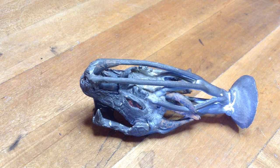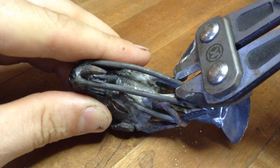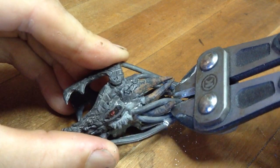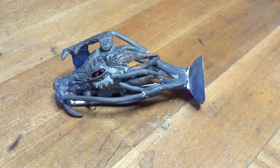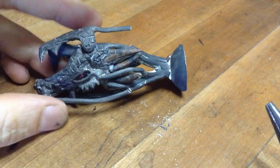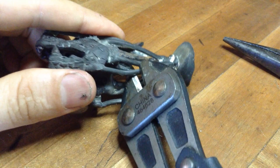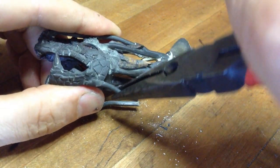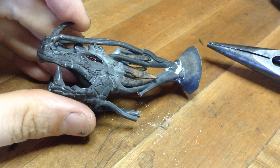When you're de-spruing, the fastest thing to do is take your bolt cutters and clip the sprues. You don't want to try and get too close to your actual details when you've got this much complexity, because you're going to need to cut each sprue off and then bend it with pliers so you have access to where you need to saw. Just go through and clip everything that you can, then bend the sprue out of the way so you can continue accessing your part, and then we'll come back and time-lapse all these sprues off with the jeweler saw.